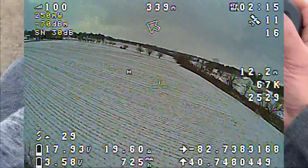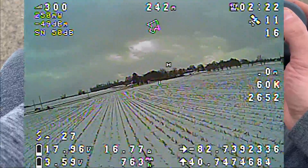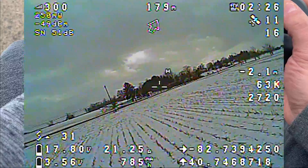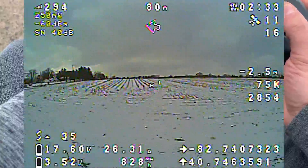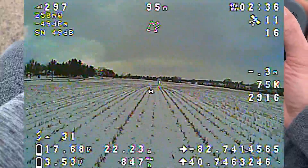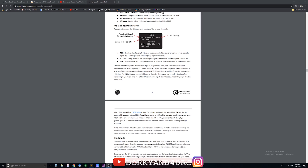I don't have the antenna pointing directly at it at all — just kind of pointing straight in the direction and things seem to be hanging on pretty well. We better bring it in before we run out of volts. Going back to Crossfire basics: TBS says that for each 6 dB represents twice the range of your current distance. So for example, if you are at 5 kilometers with an RSSI of minus 84, at 10 kilometers you would expect to see minus 90.